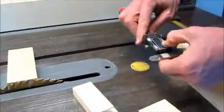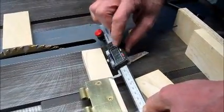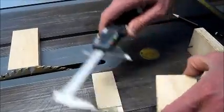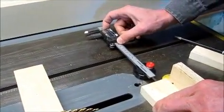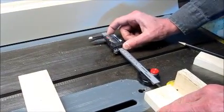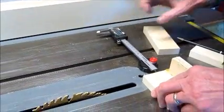The calipers were used to measure the inside pocket length and set to zero. So when the calipers were put over the board, only the cutoff amount was given. The board was then repositioned against the stop and the calipers were used after resetting the zero to move the board the correct distance away from the stop, and it was trimmed to length.